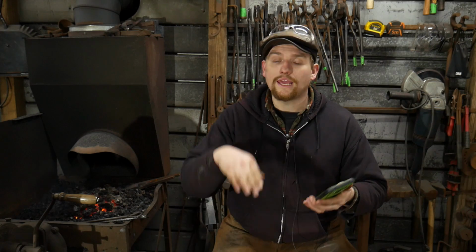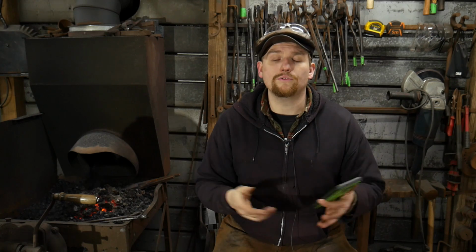But moreover, to J.S. Ferrier's point, no, in order to weld you don't need a scarf. You can lay two pieces of steel on top of each other, just like in the instance of Damascus work, and you can just weld them right up. They're not scarfed together. There's no goofiness going on there. It's just flat steel stacked on top of each other. So as long as the surfaces won't trap scale, it welds up fine and you've got a useful billet.